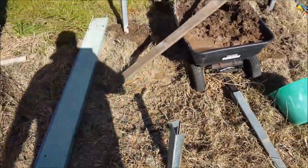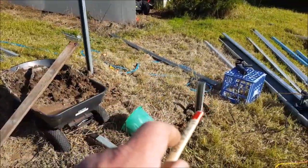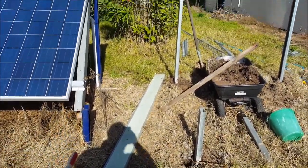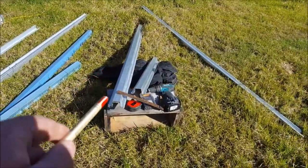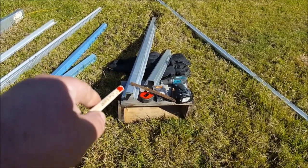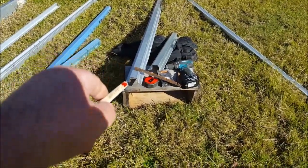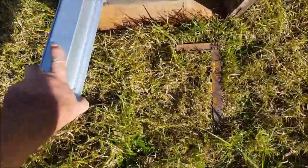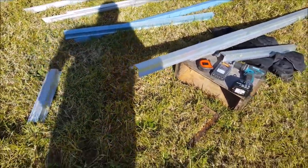It's about 20 past 11, Tuesday 14th of June. So I've got the posts in — one, two, three, four. They're also level with the corresponding posts on the old solar system. I've also cut up some of these top hat purlins, because I don't have any at the four metre length. The beautiful thing about these purlins is it's just a matter of screwing them together. I've got them cut to just over two metres, and I've got some joiners — it's just a matter of overlapping and screwing them down to get my four metre purlins.